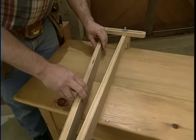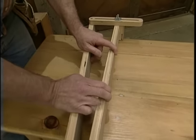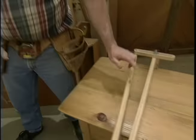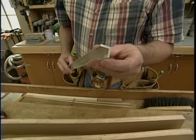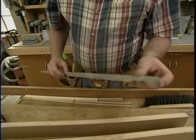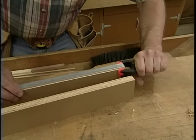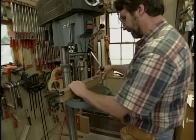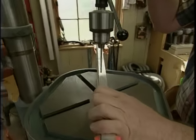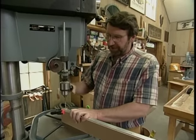One of the things I've discovered in using this jig is that the side that I put the stock against sometimes gets bowed, and it's also pretty flexible. So I'm going to stiffen that in the one we build now. I'm going to use a piece of heavy-duty, eighth-inch thick aluminum angle, which I can buy at my home center or hardware store. I'm going to set it on what will become the bottom edge of that leg, clamp it in place, and drill some holes for some screws. Now we'll switch to a countersink for the head of the screw.